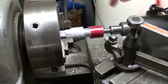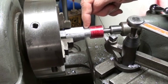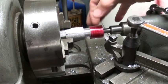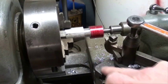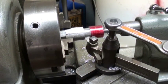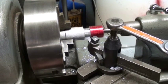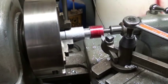Just about ready to start our cut here. This is aluminum, and we're going to turn what you see in red — I put some red dye on there. I have an undercut there so we don't have to deal with shoulders in this video. I'm going to show you how to turn to a shoulder in the next video — that's why the undercut is there. We're going to turn this down to a certain diameter. Another thing to watch: your compound rest should not strike the chuck when you get to the extremity of your cut. Always run it into that position and rotate your chuck jaws by hand to make sure everything will clear and you won't damage the machine. In the high school, every one of the compounds is chewed up beyond belief from striking the jaws.